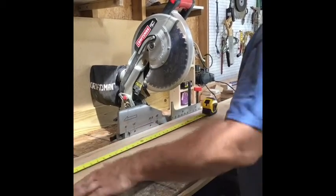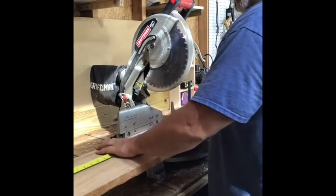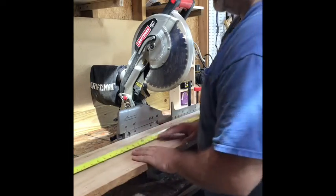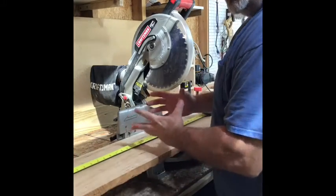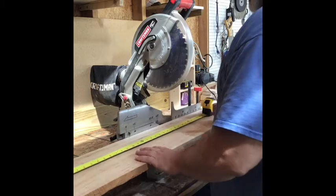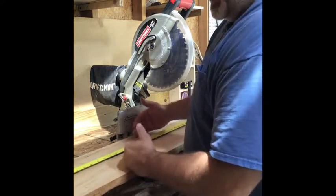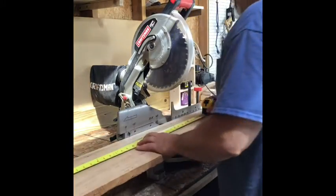The first thing I have to do is cut my wood into manageable strips because I need to get a straight edge on all the boards and none of them have a straight edge — they're rough sawn lumber. Since I need 33 inches of wood for my countertop, I'm going to cut it into 35 inches, because on that last inch I'm going to be putting a nail for my guide board. My guide board will allow me to cut a straight edge onto these.